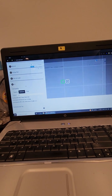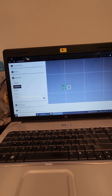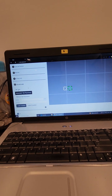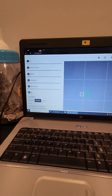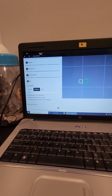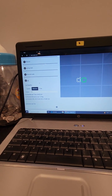Then you say generate job. Let's see where it generates. Okay, here, downloads. Then we go to the cut, click this one, say no cut, and on this one say center line, no tabs, no leads, nothing we don't need, and then cutting, again medium. See, this one says 2:03, a little bit bigger, that's why. You can do fine, but you have to play with your materials. This is my material, I know it's going to work, it's going to cut with this feed rate. Technically, how it works is that cutting is all about the feed rate.